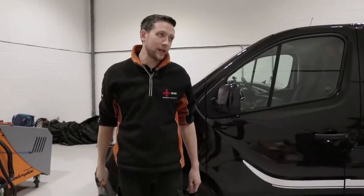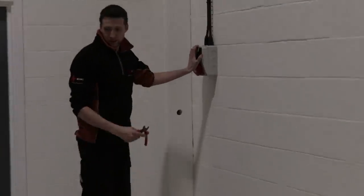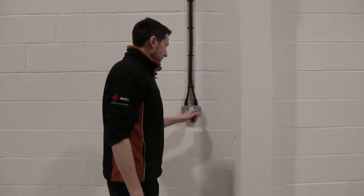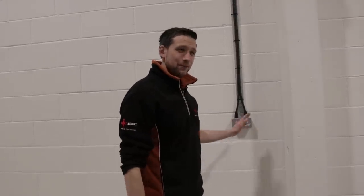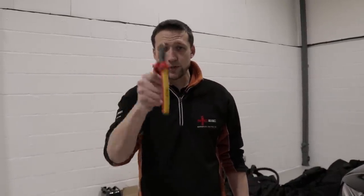Right, we are about there. I've had enough tonight — let me give you a quick tour of what we've done. The trays are all in, we've put the isolator in for the three-phase cleaning machines, they wanted a socket there. I was going to fit USB sockets but on the basis that they're incredibly unreliable I decided to stick with the old-fashioned ones. Talking of which, I saw in TLC this morning they now do small USB-C sockets — first time I've seen them, 15 quid each — so that was another reason I decided not to fit them here. Trays carried on all the way around and to those two over there, put up higher in case cars back into them as this whole area is for valeting. We're back here tomorrow to fit the CCTV, so that'll be another video — probably for next week. See you next week, take care.